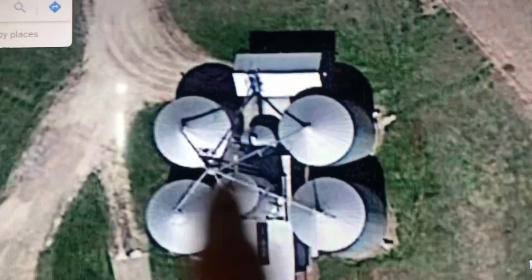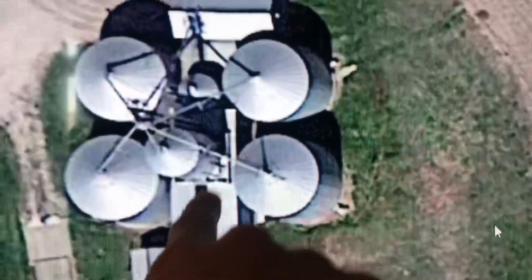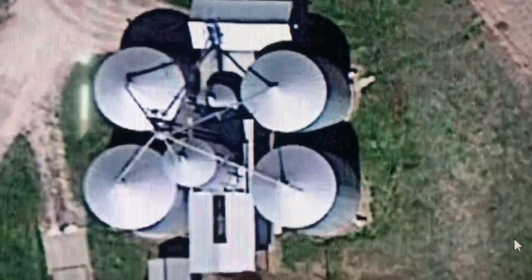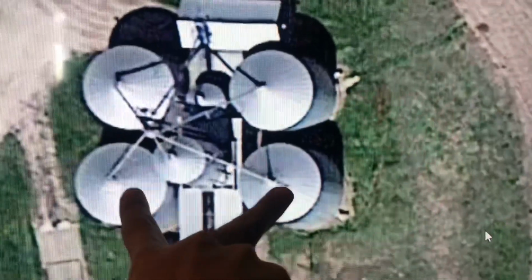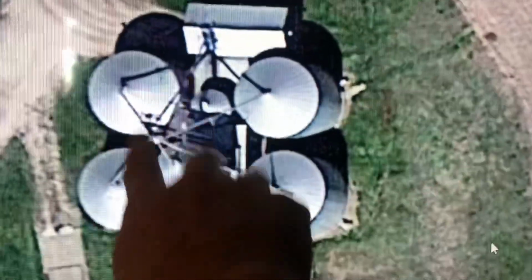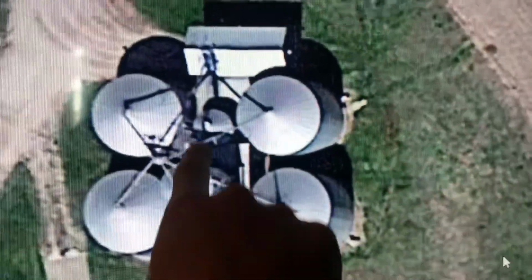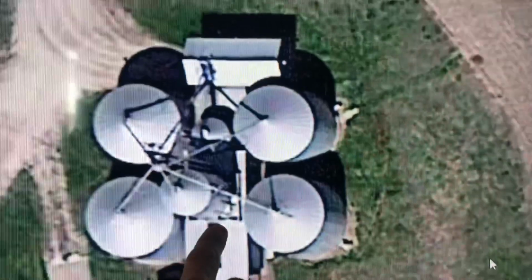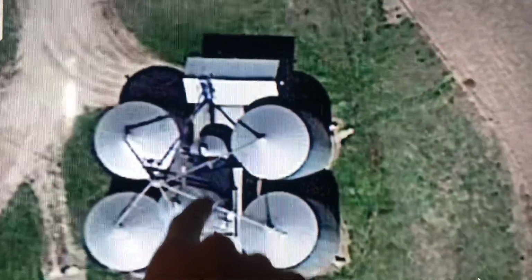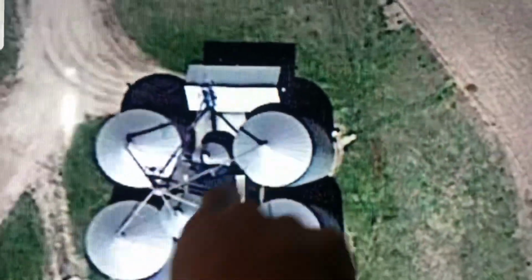but if the videos didn't do things justice, here's an aerial picture of the bin site. Now, there is a dryer right here, and it is a very big dryer, but it is out of commission, absolutely shot. These 2 bins and these 2 bins, making 4 total, those are where I'm going to store grain. That bin and that bin are just overhead bins. That one would feed the dryer, and the dryer would kick wet or dry corn out into this bin, where the leg would bring it back up and put it into bins.